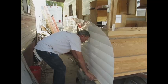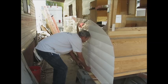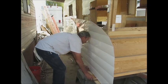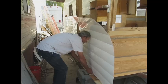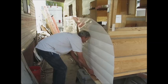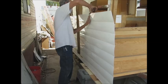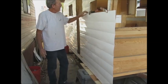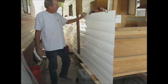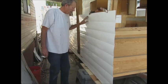Get your wedges underneath — you can lift it up to get the wedges in. I'm doing this by myself; you'll have help. I had help yesterday when I put the big piece up. Get those wedges in there so it's nice and tight, keep pushing them in until it's good and tight. Once you've got that good and tight at the bottom, go ahead and put some clamps up here to hold it at the top. Normally you're going to be about an inch over this seam.